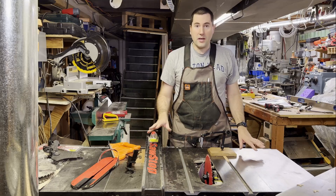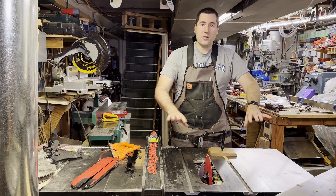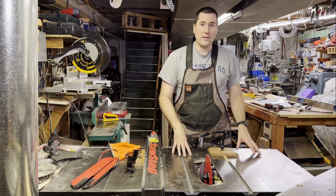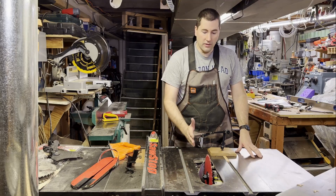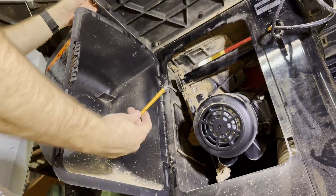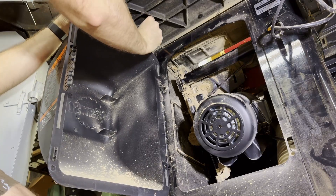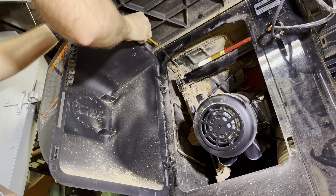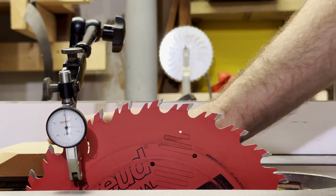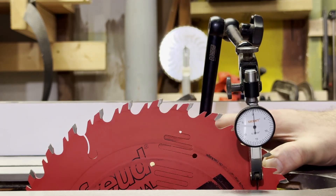This is quite fiddly. It took me a couple of different tries — adjusting the screws in each corner, measuring it, adjusting the screws again, bolting it down, measuring it, unbolting it, adjusting a little bit more, bolting it down — until I finally got it to a good level of parallelism. The positioning screws are unfortunately too far in for the short end of my allen key, so I had to use the long end with pliers to loosen them. After quite a bit of fiddling, I've gotten it to maybe a half a thou variation from the front to the back of the blade, so I'm quite happy with that.